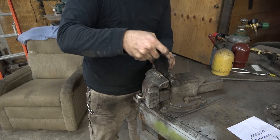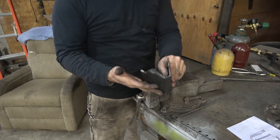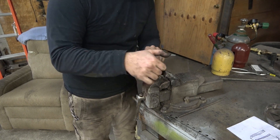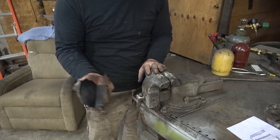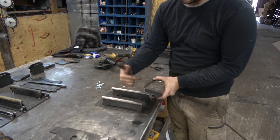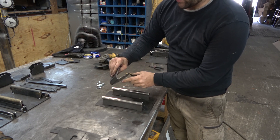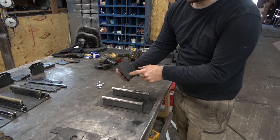Both sides may start to bend — that's okay. We're just trying to get close; you don't have to stress about being perfect yet. Put a bend on this little tongue while you're at it. When you start your bends at a vise, it's going to be easier to finish them up by hand later because you've weakened the steel. Continue until these two plates are parallel to each other and this back plate's at a 90. You should just be able to do this by hand. Once one angle has met 90 degrees and you like it, put two tacks along here on the outside.